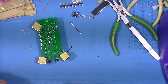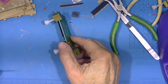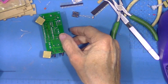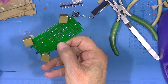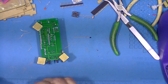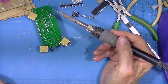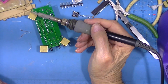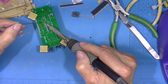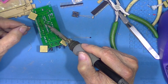Your mileage may vary on this advice, but I like a board that sits as close to the deck as possible, not held up in a soldering vise. On the deck is a better place, in my opinion. I hold the iron and rest my hand on the deck, so I'm not trying to do something up in midair.